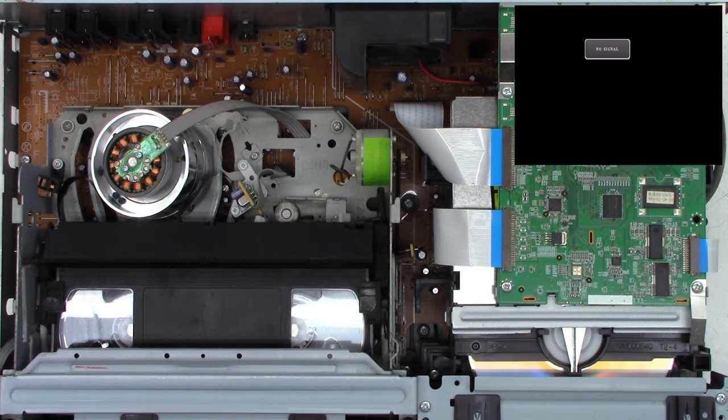These are all 330s, 0.8 ohms, that one's a little bit high for me. 0.3, good. 0.3, good. 1.3 ohms, I definitely want to replace that one. So I'm just going to put a red mark on those two. Those are the ones I wish to replace. Whether the customer wants me to do it or not is going to be another story.